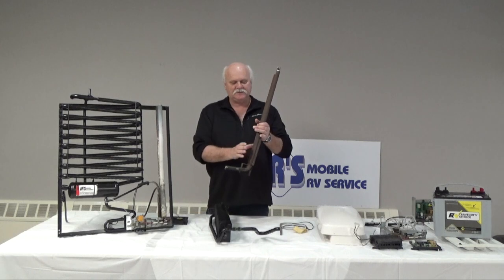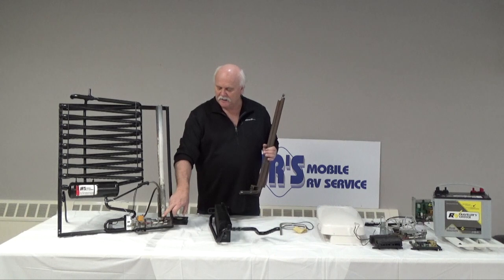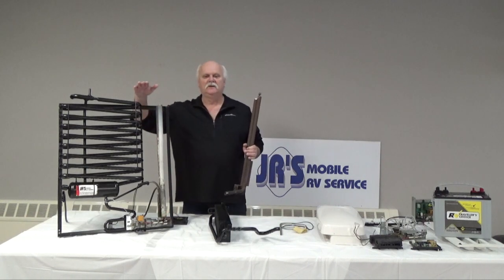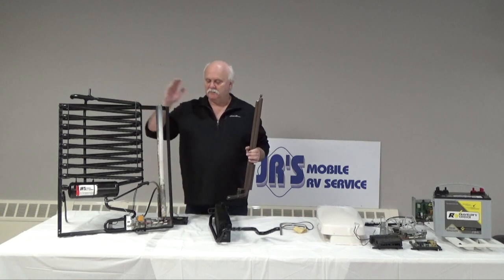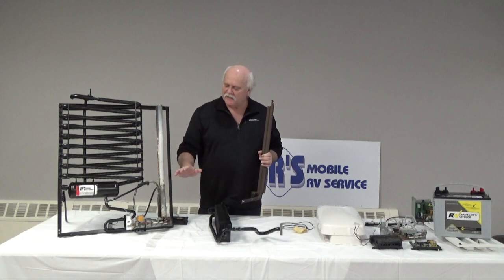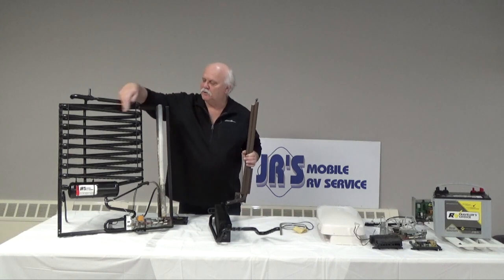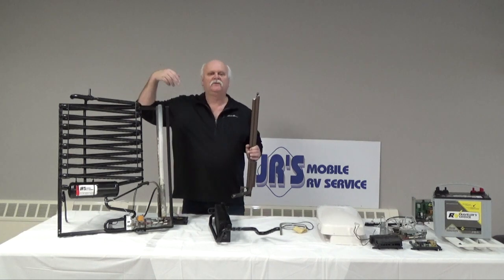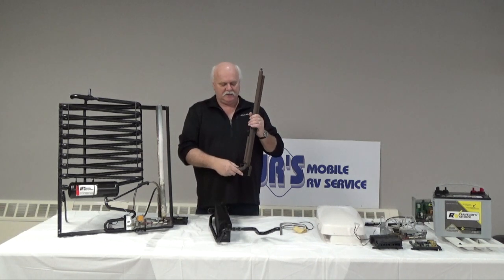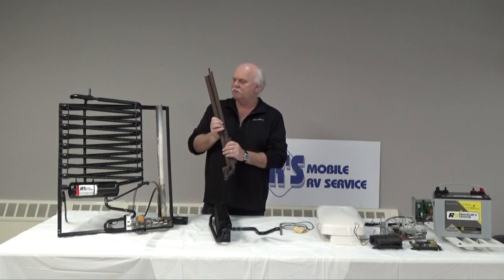The pump tube, which is this tube, got a leak in it, and therefore it leaked all of its hydrogen out. When that happens, the freezer can cool, but the fresh food compartment will stay warm. That happens because there's no way to circulate the fluids through the pipes in order for them to be efficient. So that's the quick version of an absorption refrigerator.